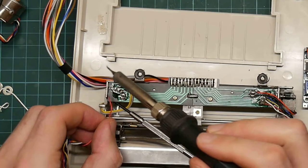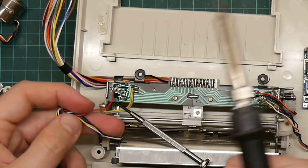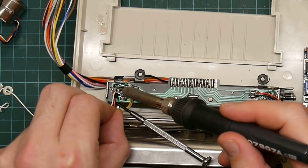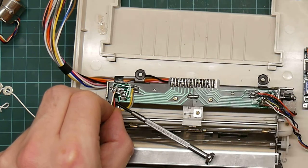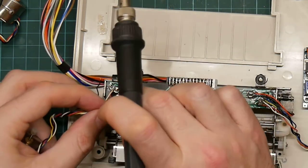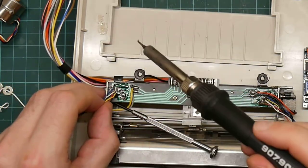These power supply modules are grey import stuff from Banggood, so very likely are under-specced. No, that didn't work. You can get drop-in replacements for these linear regulators that are sealed buck regulators, same pinout, same form factor, except no heatsink. So maybe I should get one of those and try and see if it works.